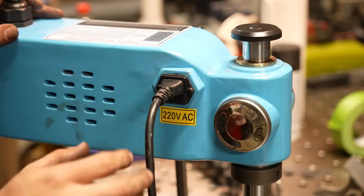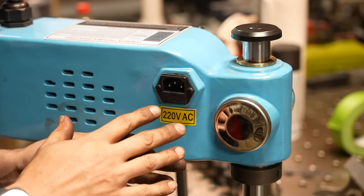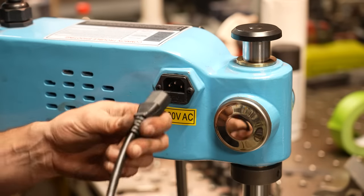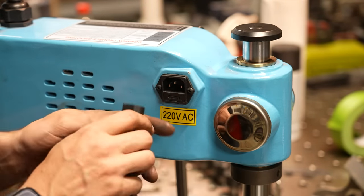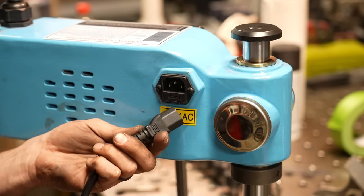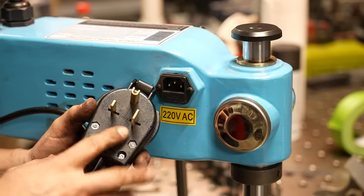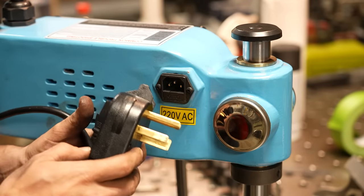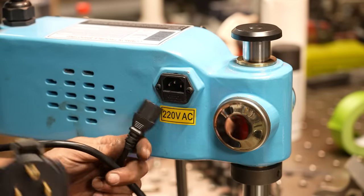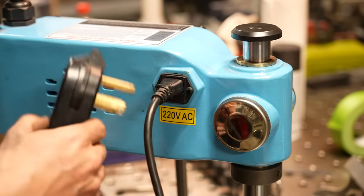If you go and buy one of these, you'll notice when shopping that they're all 220 volt. They come with a cord with a European plug, but obviously in the States I couldn't use that. So I bought a heavy gauge cord with the same little three-prong adapter — commonly used as a computer power cord — a 15-foot cord with a welder's plug on the end. With this welder's plug, I can plug into any of the 220-volt outlets in my metal shop. I'll put a link to the one I bought in the description.